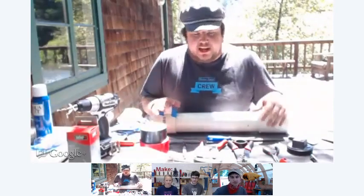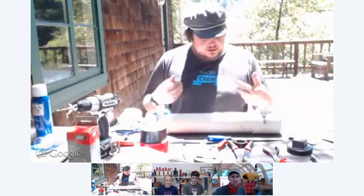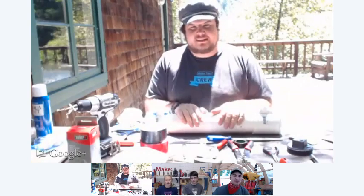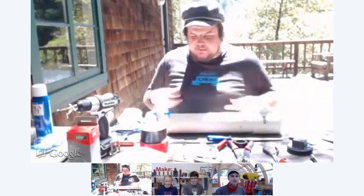It usually is. Another material you can make these out of, especially these combustion cannons, I wouldn't do it with air cannons, is what's referred to as ABS. It's usually a black pipe. And I like to use ABS because when it catastrophically fails, not that that ever happens, good to plan, though, right? Backup plan. Safety first. Safety third. Instead of fragmenting like the PVC does, it just will tear or split in one spot. Oh, so PVC shatters into little fragments, whereas this ABS... Yeah, which can be kind of dangerous. Okay. So that's why we wrap it in duct tape, because it contains those fragments.